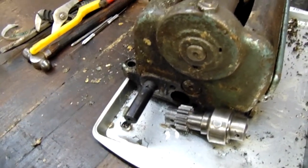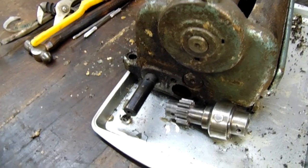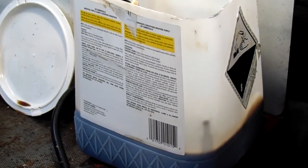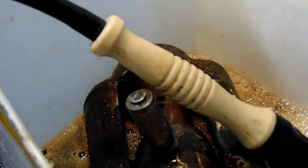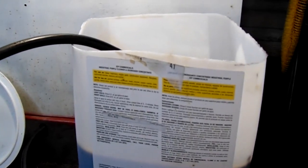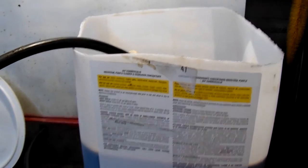Always determine what's going to give you the least amount of repair in the end — what am I going to have to do the least amount of work to fix after I've purposely taken it apart. We've just cut the top off a bucket and filled it with degreaser. Here's our gearbox in there. We're just filling it up right now and going to let this soak to take care of the most filthy stuff. When we pull it out, hopefully we can just rinse off a lot of material before we get into the real tedious process of picking out all the chips so we can take it apart, get everything really nice and clean, paint it, and put it back together.